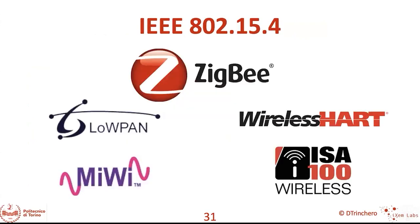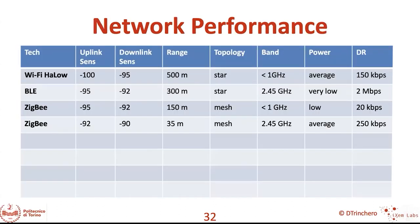Other technologies are the ones that enter into the umbrella of the so-called IEEE 802.15.4, which are technologies that typically use the mesh, so the repeaters. So we have typical ranges of ZigBee in the two frequency bands, below 1 GHz and above 1 GHz, you see, are very limited. Every single device doesn't reach a distance of more than 150 meters in the best case, but they are characterized by very low power communications, and by the possibility of using the mesh, so the word of mouth,